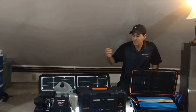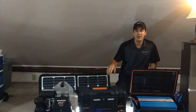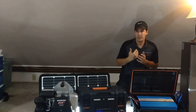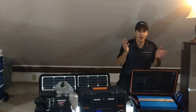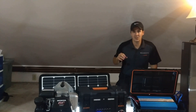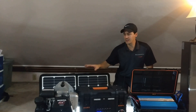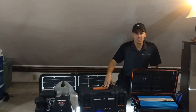The other solution is an affordable DC generator. You could buy the kit, put it together, and simply bulk charge the battery on and off. Depending on your loads, you could look at your meter and say, 'I'm down to 50% charge,' fire the generator up, give it a quick bulk charge, bring it up to 75 to 80%, then shut it down and let it cycle through again. That conserves fuel, you don't have to hear the noise, and that's really the optimum way to set this up. You could bulk charge with the DC generator and then use some small solar to trickle charge — this floats it and that bulk charges it.